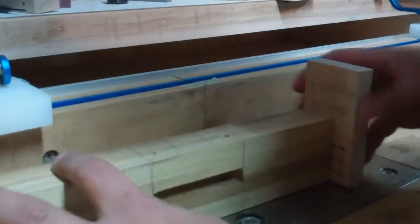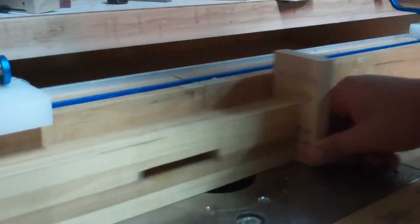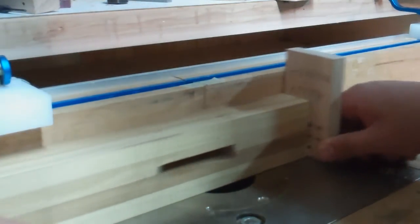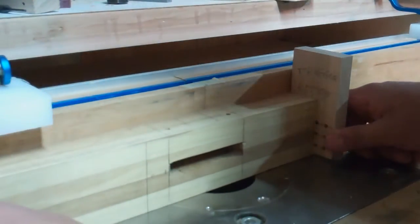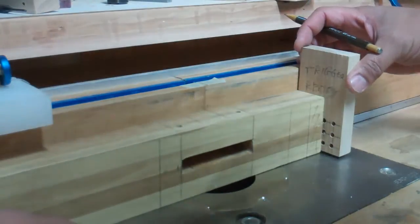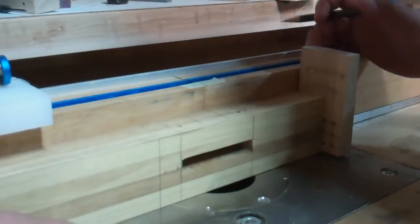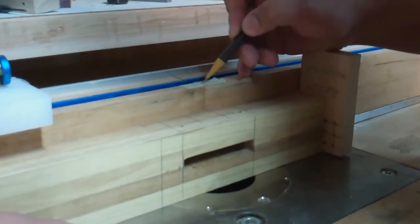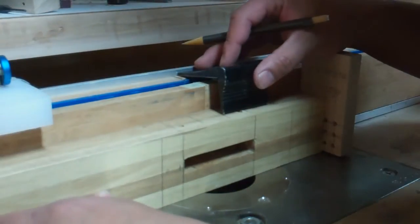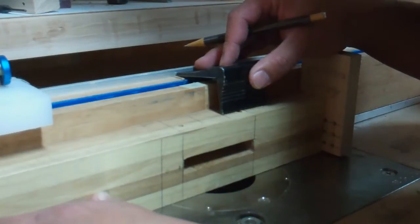Now that we've got our stop attached to the rear of the gun, you can see it'll slide up against the fence like that. So we have to limit the lateral motion of the gun blank. Here's my mark for the right side of the router bit. So what we're going to do is get that lined up with this mark, get these two lines lined up fairly closely. You can kind of eyeball this — if you're off just a little bit, it won't matter too much.